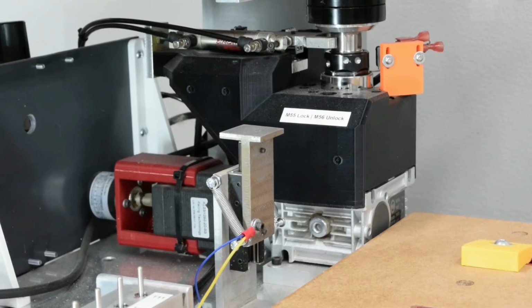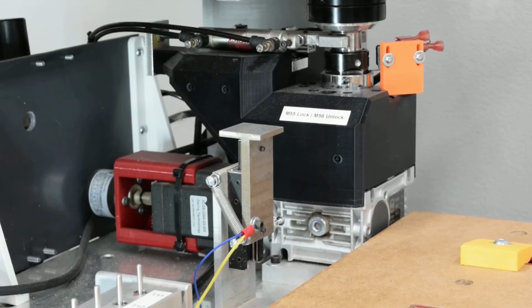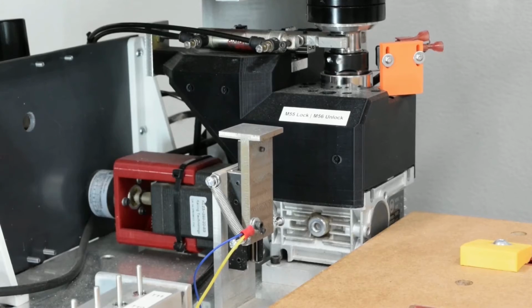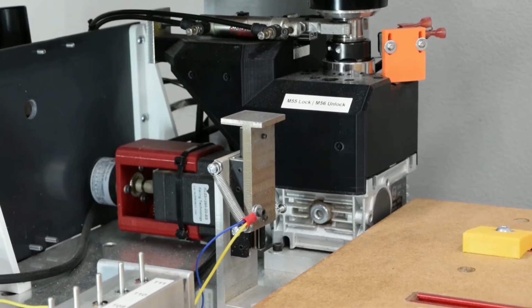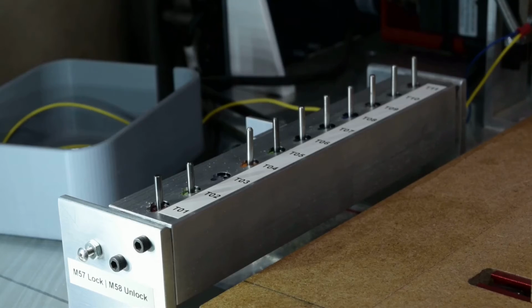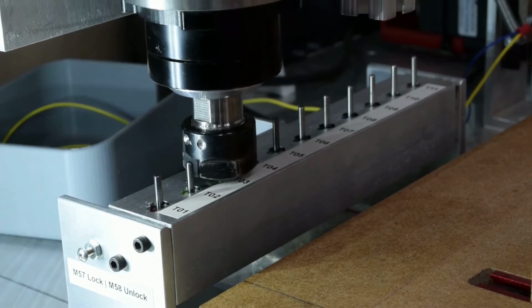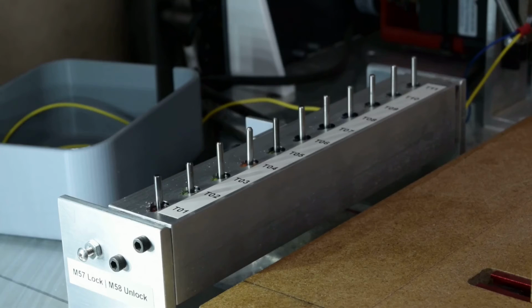This is the tool change mechanism. It's all automatic. A lot of that went through a long engineering process. Took me a very long time to design and get this whole system to work and work reliably. What it will do is it'll unscrew the collet from the spindle, and just the friction keeps the tool in there. And it will then go over and put it in a magazine, which we'll see here now. The magazine will close the cover and hold it in the magazine. It'll move over to the next location for the next tool and come down and pick that one up.